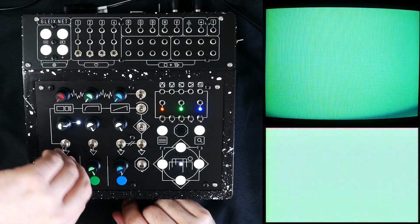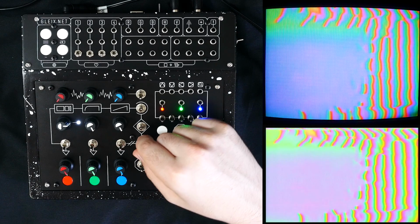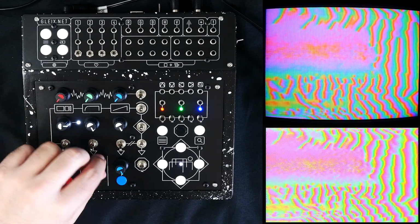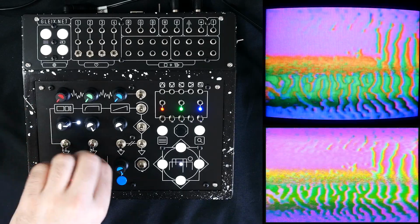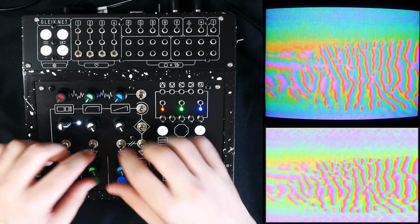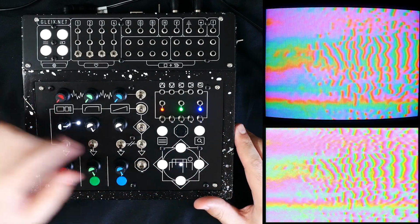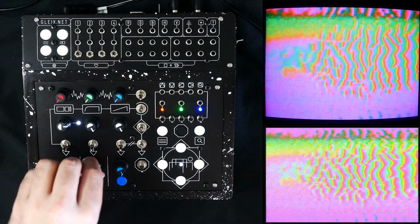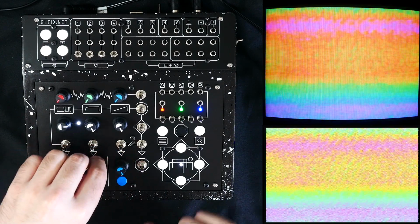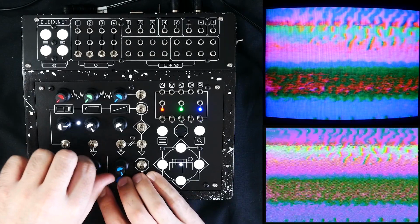And what I'm going to do is get our feedback going again, and send it back to the freeze function. It's a slit scan. So by sending that 60 Hertz oscillator signal to our freeze function, we can allow this to act like a slit scan that will freeze and then reset pixels as it scans through. Really excited about it. It's not a perfect cutoff, it's a little glitchy, but yeah, I'm happy about it.